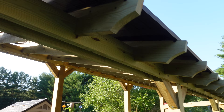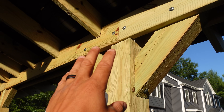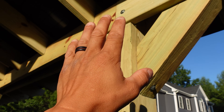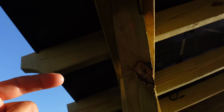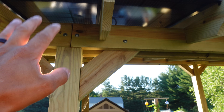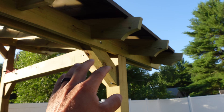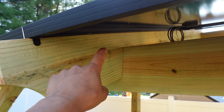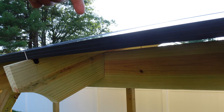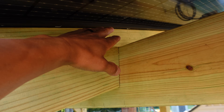There is also a list of bolts and materials used throughout the build. For the lag bolts on the 45-degree angles and on the horizontal beams going straight across front and back, I put a three-inch lag bolt on one side and a five-inch lag bolt on the opposite side — did that on every single board. For these vertical boards angling the solar panels, I used a four-and-a-half-inch quarter-inch lag bolt drilled straight down through the top of the board and sunk into the beam below so it wasn't protruding above the top — that way the panel could sit flush.